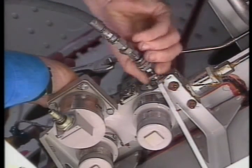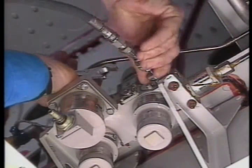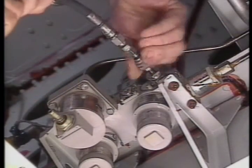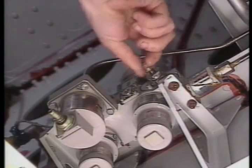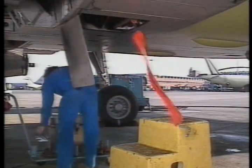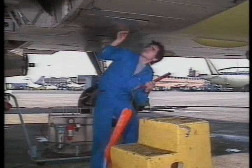Fill the reservoir with air until 50 pounds per square inch is shown on the reservoir pressure gauge. Turn the nut to close the ground connector. Remove the pressurizing tool. Install the cap on the ground connector, then install the brown connector which is related to the ground connector.